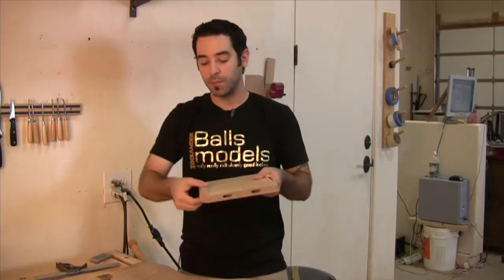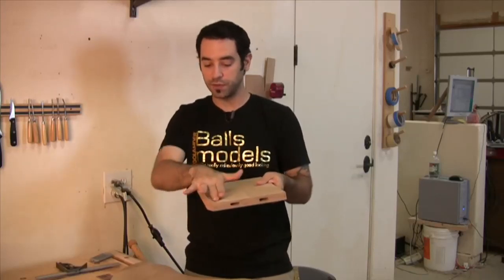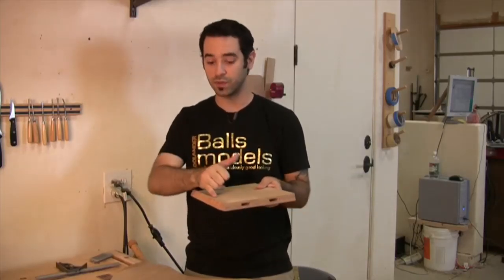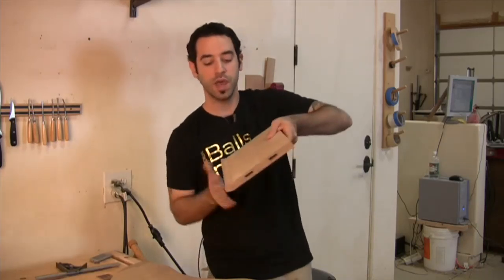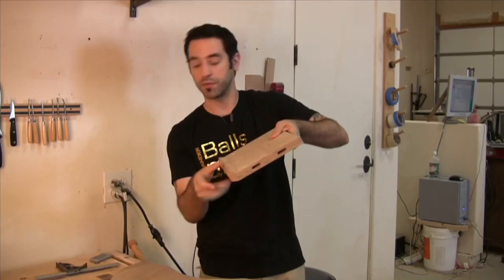The problem is that's when it's sitting flat, but when I glue it to this piece in the front here, I actually have a 65 degree angle on the front of the shelf. So when I tilt it back, I'm essentially left with a compound angle on here, which is not how I cut it. I cut a perfectly normal 10 degree angle as the piece was sitting like this, perfectly square.